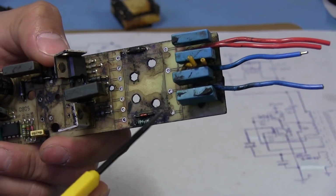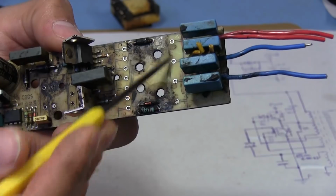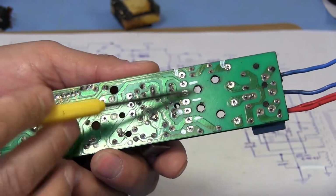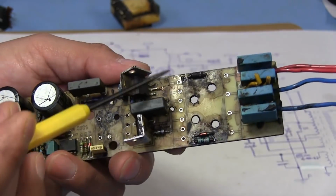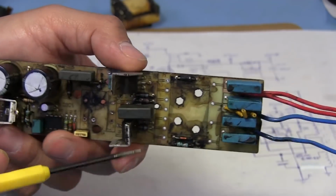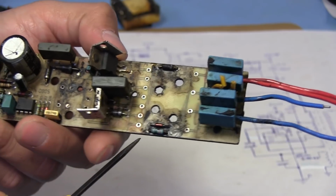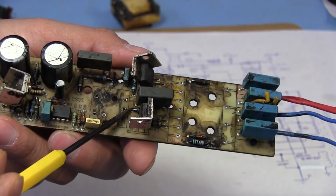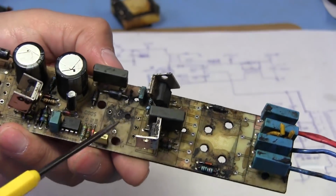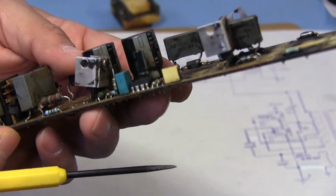That's actually pretty surprising, and it's meant to be fairly reliable as far as I can tell. If it was only soldered at the bottom, with nothing to go through, then these would be pretty weak, susceptible to cracking and stuff. But they actually did a pretty good job, in my opinion. The solder comes all the way up, and the pin is soldered on both sides, so that would be pretty good contacts on pretty much everything.